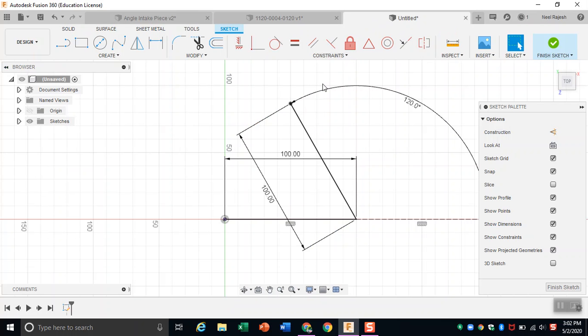We're going to go to the line tool and then create the thickness of our piece. We want it to be strong enough so that it won't break on contact with the robot. So we'll make it 10 millimeters, about a centimeter. And then after that, we'll just plug in the dimensions we had for our channel. So it was 48 by 48 this way. And then we can just cut it off here. So that is our general shape of our angle piece.